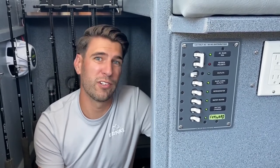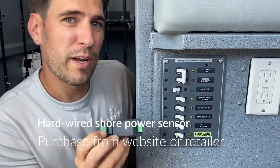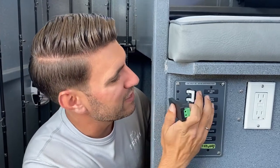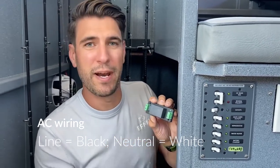The shore power connection is really important — when shore power is disconnected, you're charging batteries from your alternator, solar panels, generator, or other source on board. Find the AC panel on the vessel and connect the shore power hardwired transformer behind it. Pick a non-switched spot so that flipping a breaker doesn't cause the barnacle to read shore power as disconnected. Typically you'll wire directly to the AC main or directly from the inlet plug, connecting line and neutral directly to the shore power transformer. In North America, line is black and neutral is white — and make sure everything is disconnected when working with AC power.